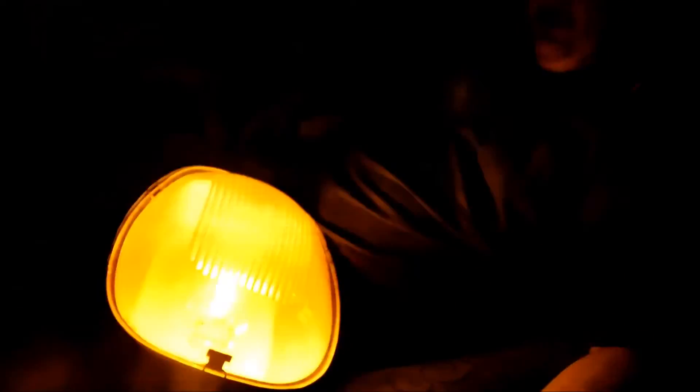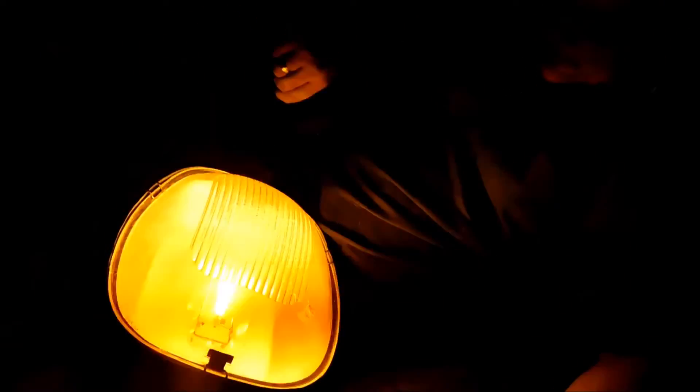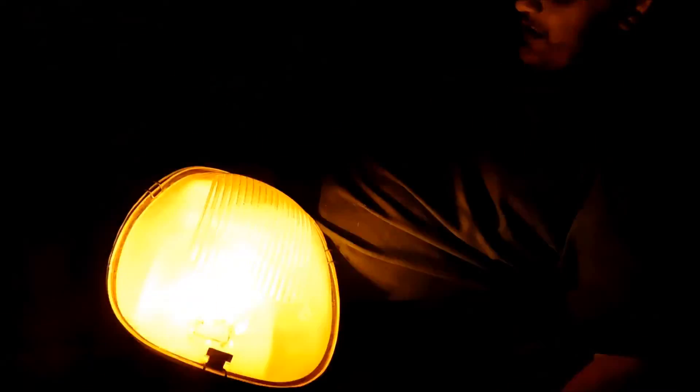In fact, most of my collection is lights that have been taken down and replaced for some of the silliest faults — like a blown PE cell. They take the light down and replace it rather than simply removing the PE cell, putting a new one in, and leaving the light where it is.